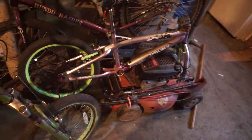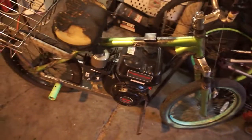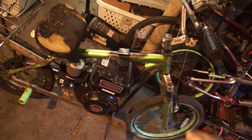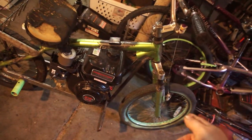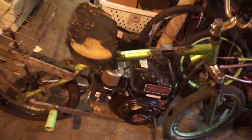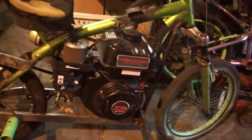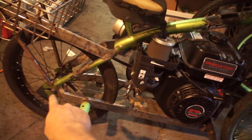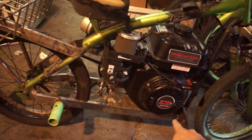So this is what I got set up with my bike. The frame started out just like this one here, that little purple thing. The front end is higher because I used some different forks because I wanted the suspension. The suspension sucks so it's welded up now. But with the front end lifted up that much, just enough room to get this engine in here with some straight tubes that are level with the ground.